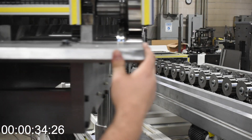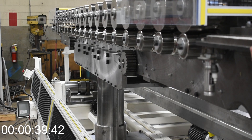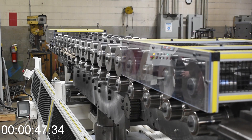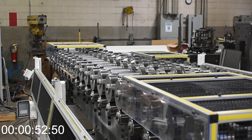The lifting and lowering motions are hydraulically powered while the rotation is manual. Two vertical guide rods assist with the alignment before the lowering process begins, and before the forming head seats into the machine, it settles into two cradles that provide a more precise alignment.